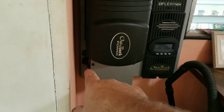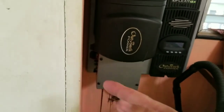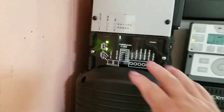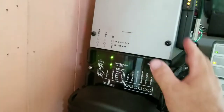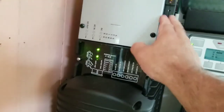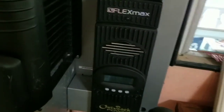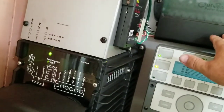What you're not really seeing over here is a bunch of breakers — there's a PV array breaker, a ground fault array, all kinds of others, and a big battery disconnect. Up here are all the AC breakers for everything. This is the inverter, taking 48 volts DC and making it 120 volts AC. This here is what Outback calls the FlexNet DC — basically a battery monitor. This right here is Outback's famous 80-amp charge controller, used all over the world. And this is their network hub — a communication hub.